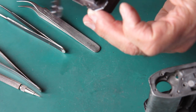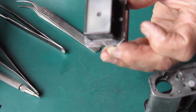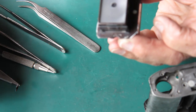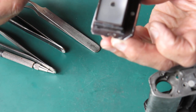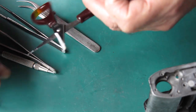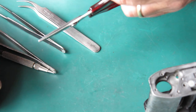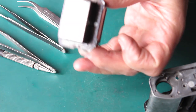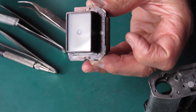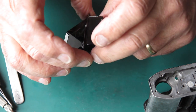This tape I'm using is a duct tape. It's one with fibres in it, cloth fibres, so it doesn't really stretch. And that's important, because plastic adhesive tapes that stretch will also contract, and they'll let go and they'll change shape, and they won't be where you left them when you come back at a later date.